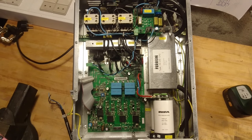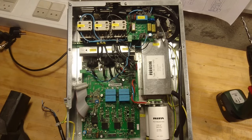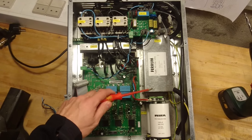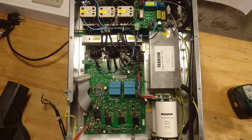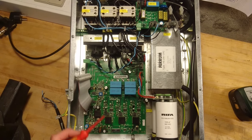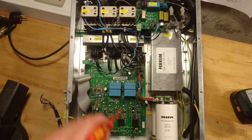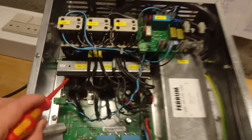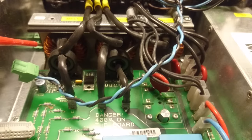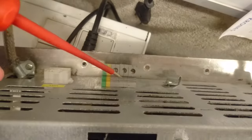With the lid off we can see that this is pretty much a straightforward inverter as you can see for any motor drive. There is a huge input filter, some DC bus caps, a driver section for the IGBT, and a three-phase IGBT module underneath the PCB. The outputs go through three large inductors, and the output goes through one of these three contactors to the motor out terminal on the back.